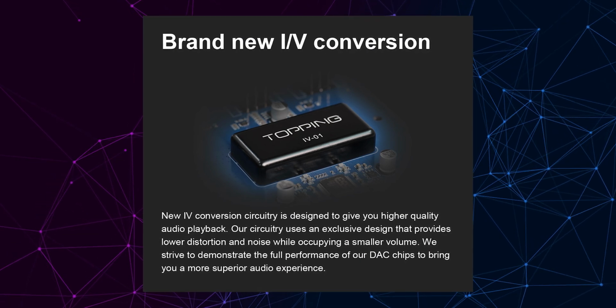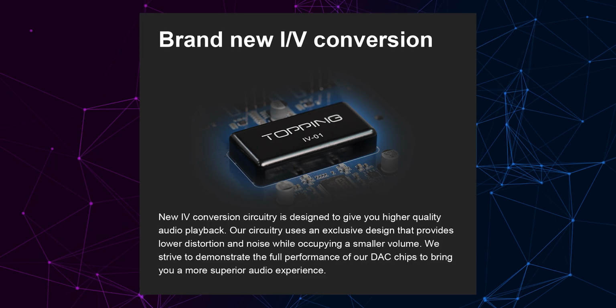That's exactly this one, costs $699, and for example, D90 SE goes for $899, but spec-wise, performance-wise, these units are pretty much the same. They have also a brand new current to voltage converter stage, which is called IV1. It's encapsulated, so I cannot have a peek inside that one, but I presume that they are using op-amps and discrete components, a hybrid IV stage, because you can feel that it's quite a powerful one once music starts playing. MQA is no more, so that can be a plus or a minus depending on who you ask. And it also has a brand new Bluetooth receiver that supports all those fancy new codecs, aptX adaptive, LDAC, and so on and so forth.